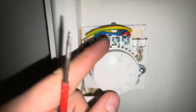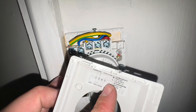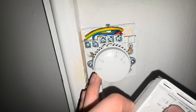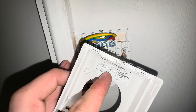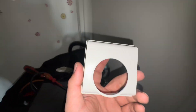You've got all your instructions here. Live usually connects normally closed on four. If you click the thermostat, one and four switch to one and three, sending the signal. Pretty straightforward — it's like a train on a track switching direction.